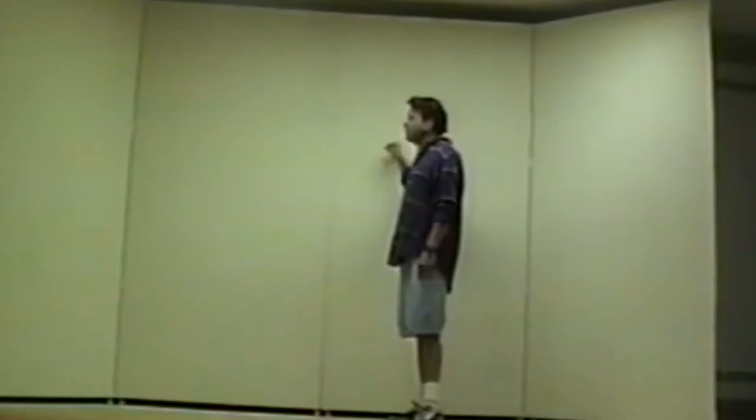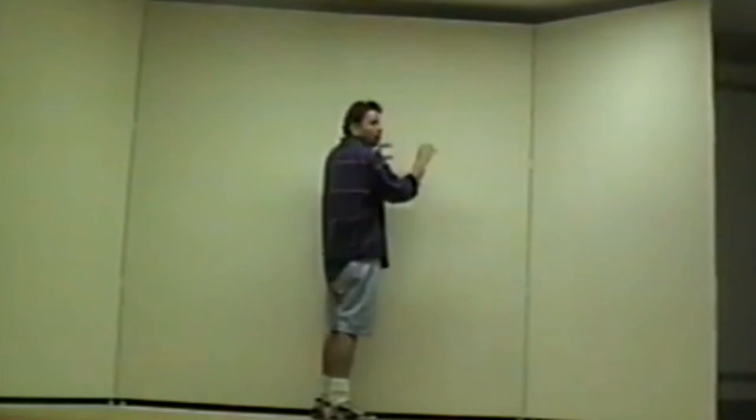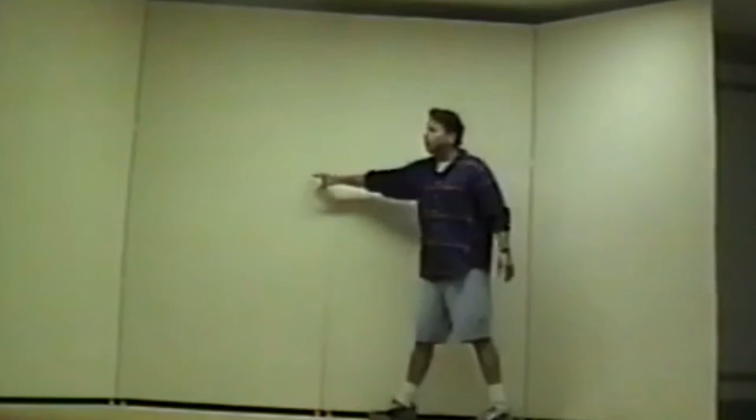Now, after that was done, you take a drill to do a starter hole, then your jigsaw, and you cut out your puppet windows with your jigsaw. And you sand the edges, and then I'd put another piece of framework, just like the 1x2s or a reasonable facsimile, underneath the puppet window. Let's say the hole was right here, above my hand. I would take a piece of framework and put it right to the edge, flush, so that would give support to the window so it wouldn't be wobbly, and it would also give more support to the whole panel.